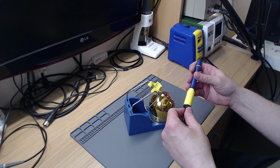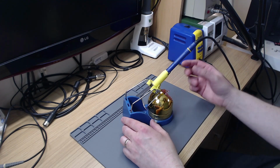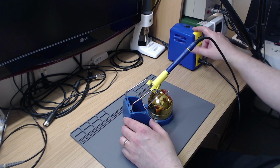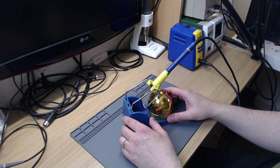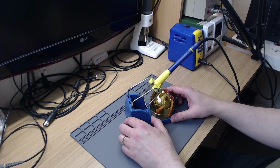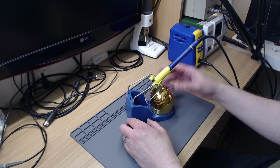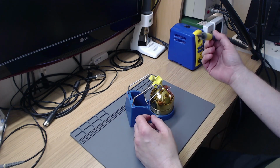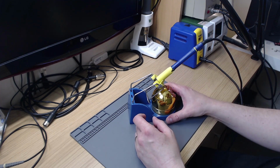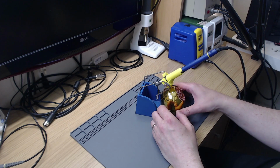The only persistent issue, which is annoying with the thing, is that about half the time when you turn it on, when the base unit is heating up the iron, it starts to beep like crazy. The thermocouple warning, the heater warning comes on, and other times it'll be fine. Normally it should just beep when you actually take the tip out while it's running, but that's pretty annoying. And I put some tape over the buzzer, but the problem persists anyway, and it's just mildly irritating,